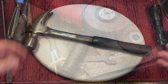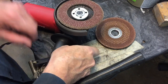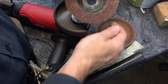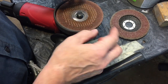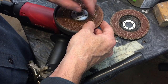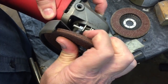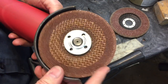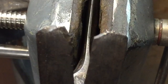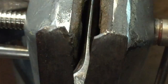Let's make this into something we'll use all the time. We're going to work on the back claw part of the hammer — it's got a little chips. We're going to sand that down. To do that, there's a spanner wrench — a pin wrench — that comes with the tool, and you just loosen up this little collar, remove your flap disc, place on your grinding disc. You see here it's a solid disc; it'll hold up much better. I don't want to ruin the flap disc on the corner, so just tighten this down. There's a little button on the back that locks it — lock it down and you can turn it by hand and it'll lock itself in. That's how you change the disc.